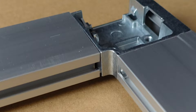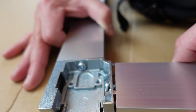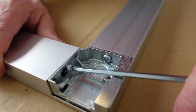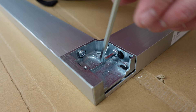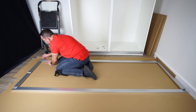It's going to come in nicely. There are four points on the edges you need to get into. Exactly the same on the bottom side — see those four points? They're going to come into the corners in the dividing panel. Put the screw in and push it all the way down. Same on the last one — slide it in. Now get the Allen key with the screws and secure the frame, just twisting the screw to the right side. Cross with the long side of the Allen key so you have better access. Don't go too hard on those screws — when you feel enough resistance, just stop, because you'll overrun the drive in the screw and then you won't be able to open or close it anymore.